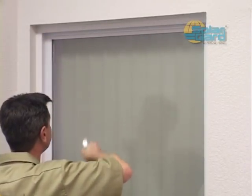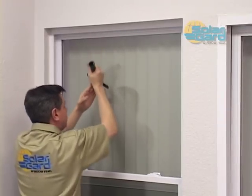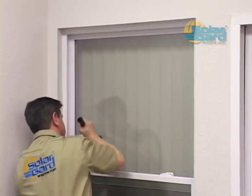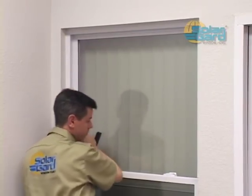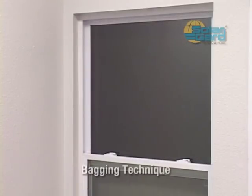Afterwards, spray the window with application solution and again scrape the glass with your Triumph scraper. Clean the blade as needed and dispose of any adhesive residue properly. Before installing new film, re-clean the window as shown in an earlier segment. This technique works well on PS adhesive films.